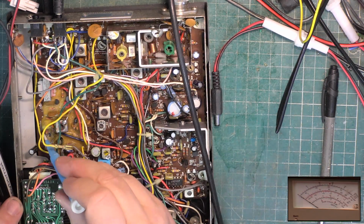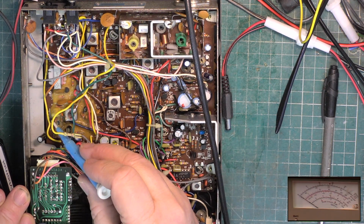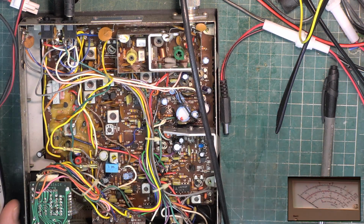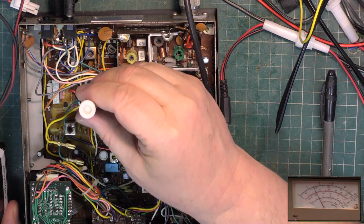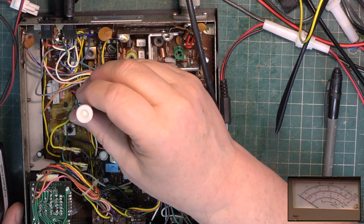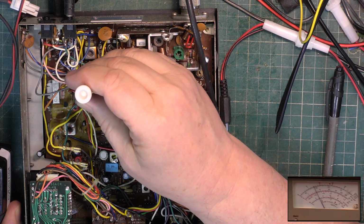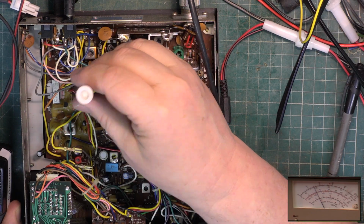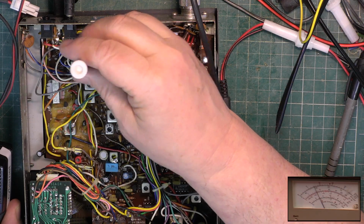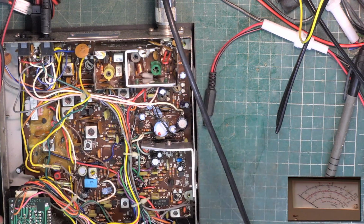So, and the test points, as I've said time and time again on this channel, is the far side of resistor 4 there. So we go through the transmitter, we want the centre of the peak. That was spot on. But we know something isn't spot on because it's very lopsided and it isn't doing the 3.8 watts the manufacturer says it does. Of course, if we can get 4 watts out of it, all the better. Yeah, that was nicely out. We're now at 3.1 because it's dropping down anyway with the heat.